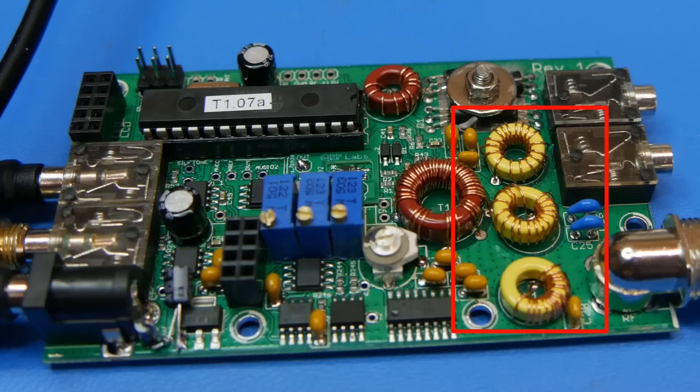This picture shows the main board of the QCX radio. There are actually a couple of daughter boards that sit on top of this — one is the display board, the other is the controls board. The display board plugs into this connector right over here, and the controls board plugs in right here. When you plug those in, these three screws and this capacitor are available for setting the radio up. This is the little capacitor that had to be added because of a mistake made during production — the capacitor on the other side of the board did not have enough voltage tolerance, so this one will handle 16 volts. This was supplied by QRP Labs and was included in the kit along with the instructions.